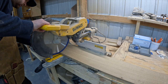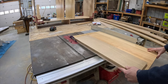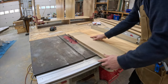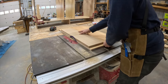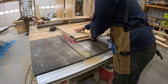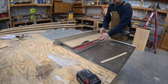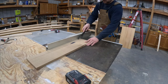With our box totally complete, I transition back to that white oak that we picked up earlier. I'm not going to go in depth here on how to mill rough-cut lumber as I just put out a video on the channel on how to joint lumber without a jointer — I'll put a link down below. Essentially the process I follow is to break down the rough lumber into shorter sections closer to the length I need, which minimizes the amount of milling needed. The goal is then to get a straight edge on one side that we can flip and put against the table saw fence to cut down these pieces into the size we need.